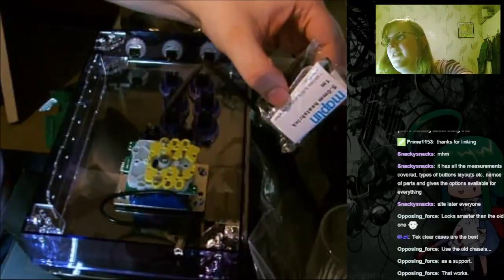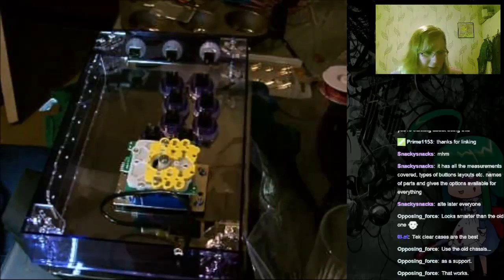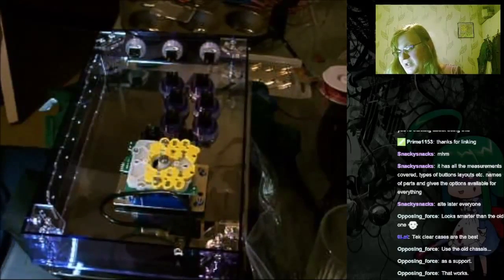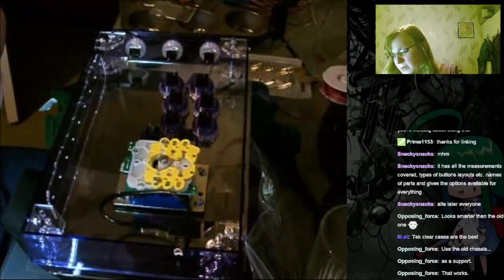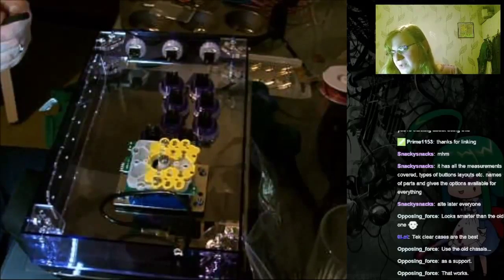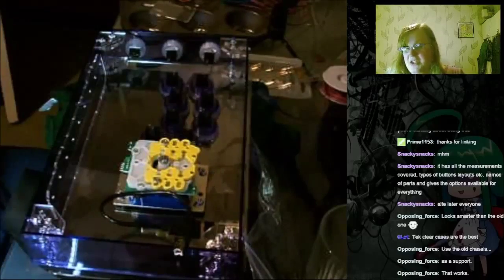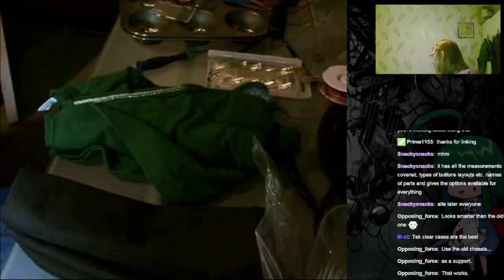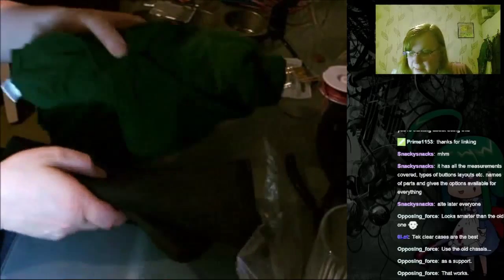There is the heat shrink sleeving, so what I need to do is it does exactly what it says on the tin. You cut a piece off, you stick it over the connector, or you stick the wires through it and then put the connector on if it's really narrow stuff, and then you just heat it up and it shrinks, and then it protects your connection. So I'm just going to move this out of the way again so I can do that for you right now.